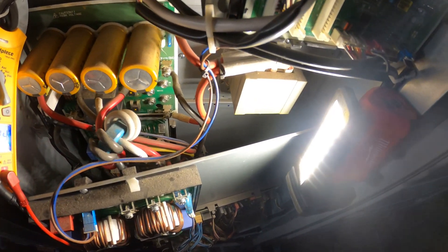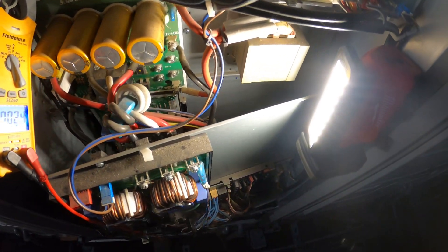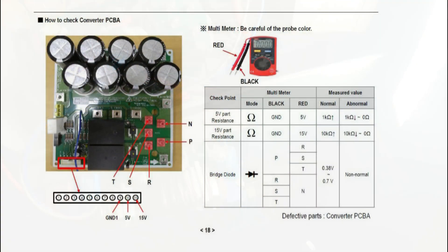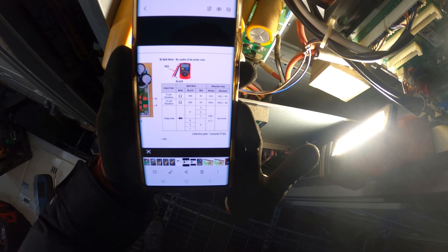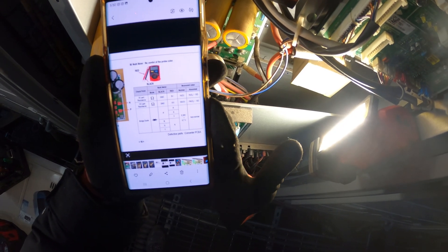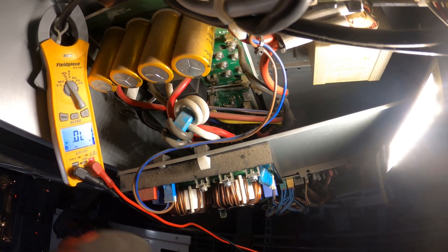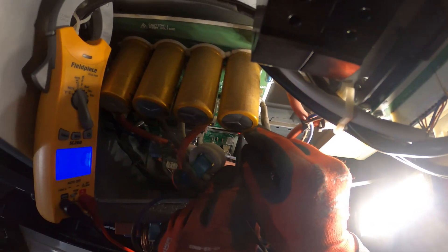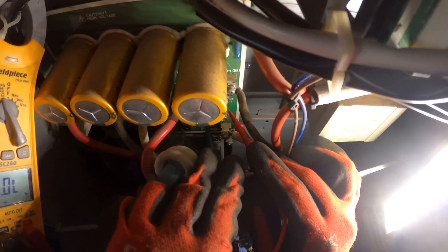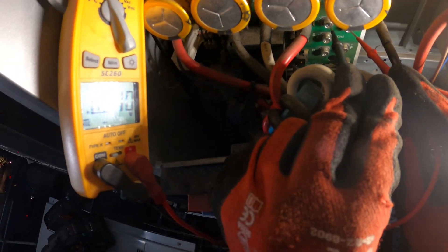You really want to check the inverter board and compressor, but this can also give feedback. So from the last call with the CH29 error code, they want us to check the diode on the converter board too. Here's P and N — positive, negative — and then R, S, T. We're going to do a diode test on this as well. Put the black lead on P and check RST — should be reading 0.38 to 0.7 volts, just like the other board. Got 0.5, 0.5, 0.5 — checks out. Next, put the red on N and check RST: 0.5, 0.5, 0.5 — that's good.